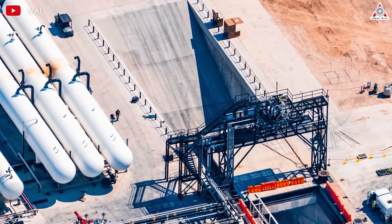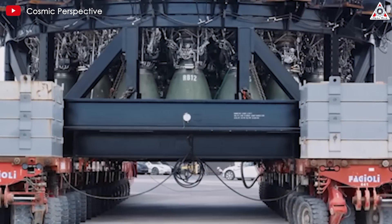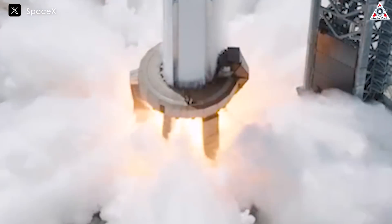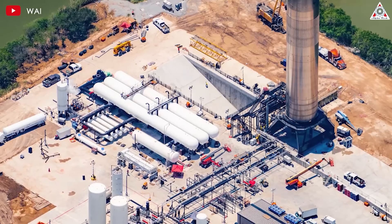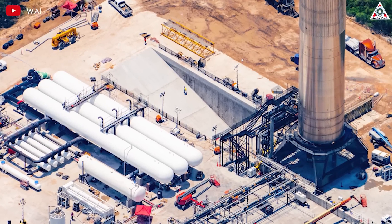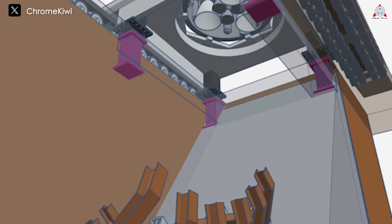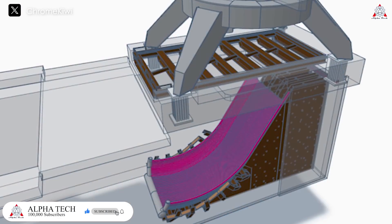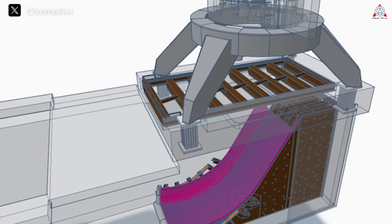The concept is similar to the flame trench system at the Massey test facility, though for the super-heavy booster of Starship, the system would need to be scaled up to handle the immense thrust and heat generated during liftoff. The infrastructure is currently developing at a rapid pace. Looking at the flame deflector SpaceX made at Massey as part of its static fire pad, the main structure of the deflector was fully built in a short period. So it's possible that within the next one to two weeks, a true flame trench could emerge at Pad B. Similarly to the test structure at Massey, SpaceX could have a mobile rocket stand, offering a reliable and sustainable method that's already been proven.